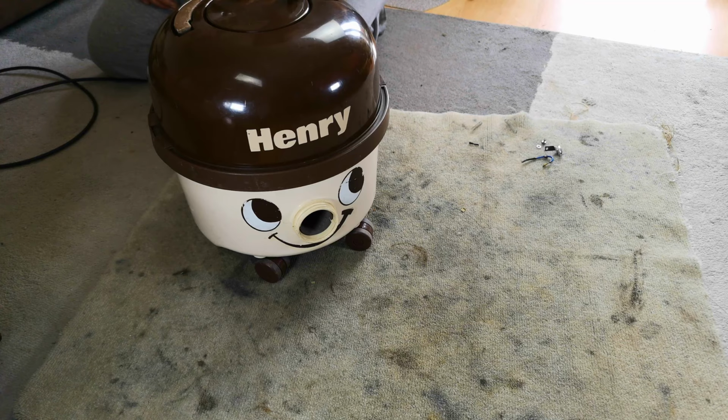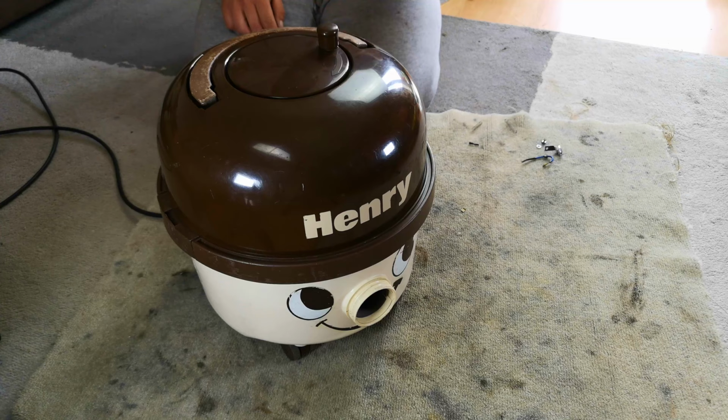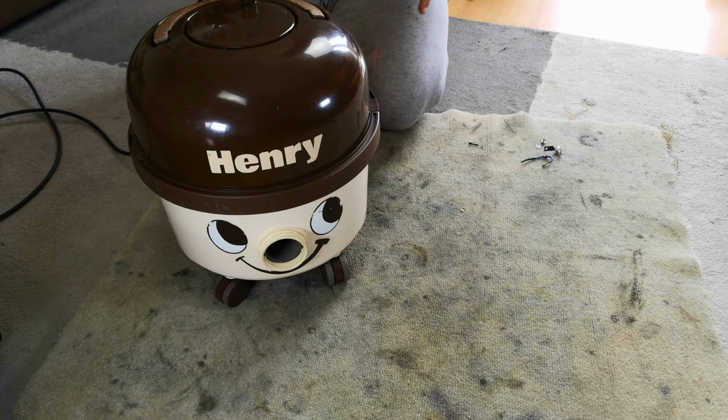He certainly does. And listening to that wind down noise, it reinforces my belief that I think I messed up with the MV200, because these are the same bearings. I bought two in here, two in the MV200, but the MV200 sounds like rubbish. So I think I need to find myself a small little bearing press. It doesn't even have to be a big one, because I think me hammering the bearings on doesn't help.